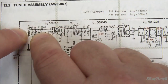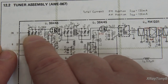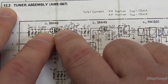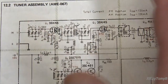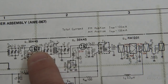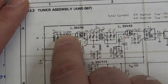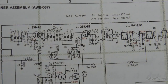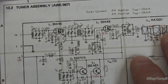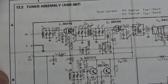The tank circuit will only resonate when a signal comes in that is the same frequency it's tuned to. When I tune this capacitor to 100 megahertz, the 100 megahertz signal can get through. It then goes into this dual-gate MOSFET — which can be a transistor, MOSFET, integrated circuit, or tube — and it is amplified. We call this an RF amplifier. Not every tuner has one; some low-end radios skip right into the IF circuit. High-end receivers can have multiple stages of RF amplification for more sensitivity.